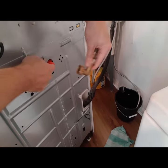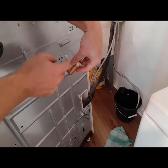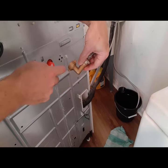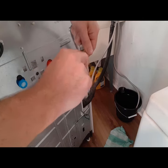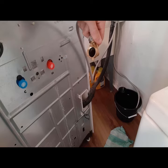One of the most common reasons for a washing machine hookup to actually leak: one, it might not be tight enough; two, it may be cross-threaded, which was an issue we had. But the other one is there's little gaskets in here, and if these gaskets get damaged like this one was, they're going to leak no matter what.